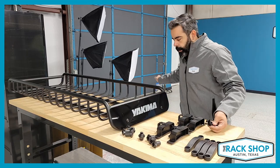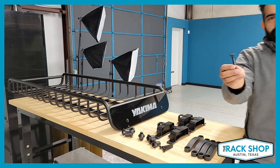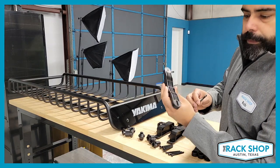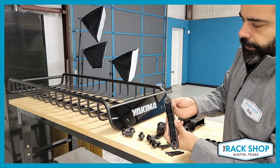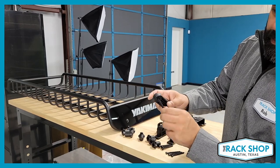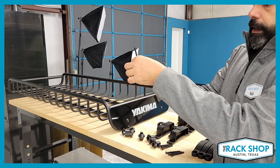Carriage bolts. These are not all carriage bolts. Four are. Okay. Four carriage bolts, and then four of these T-shaped bolts. So what's going on here, you've got this under bracket, and on part of it you're going to have a square shape and then an elongated slot. The carriage bolt will go on one side. Carriage bolts have a square head underneath this kind of mushroom top. That slides into here, kind of locks into place. And on this other side, your T-bolt fits right into this slot.